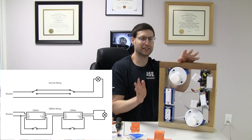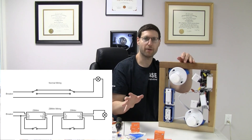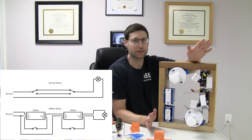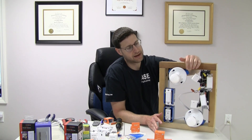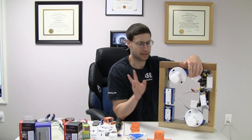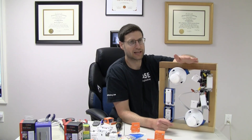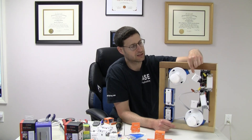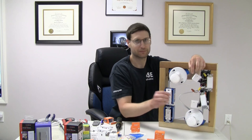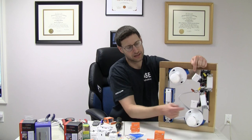If you're an electrician, you're asking yourself, well, this doesn't work because when I actually turn this off, this doesn't do anything. And this is where home automation comes in. Remember, this is Zigbee — why don't we use that to our advantage? Basically, what I've done in Hubitat is I've said that this is a secondary switch, or a slave switch, or whatever you want to call it. And this is the master switch. The only thing you have to care about is if the state of this thing changes. The rule that I installed was: if this switch changes state, toggle this one. In Rule Machine, it's really easy to set up. You say when this thing changes, toggle this one. That's all that's needed to make this whole thing work.